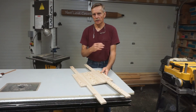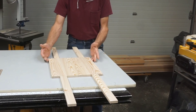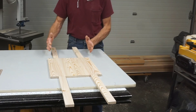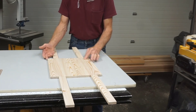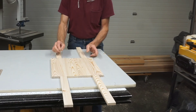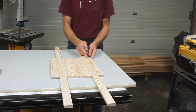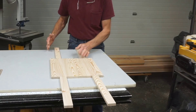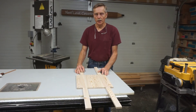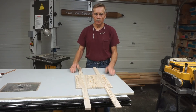Something that occurred to me as I was passing the piece through the planer is that if I didn't guide this blank carefully — because it's so wide — either one of these shoulders could have hit the guide rails inside the planer on the sides of the platen, and if that had stopped, the feed roller would have pulled this strip loose probably. So in the future I would either add strips on each side and line the blanks up with the edges, or simply line the sides of the blank up with the infeed table for safe operation.